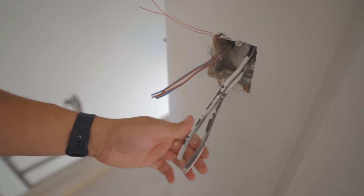This next tip is a simple one — marking up cables. It's easy when you're wiring to mark up using a Sharpie — it's really clear, sufficient, and universally understandable. But when it comes to second fixing, you want to make up a little system of marking cables that you know. For instance, a cross is a feed, one line is a switch line, two lines is a second switch line, so on and so forth.